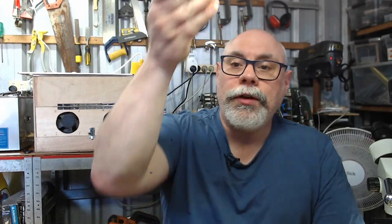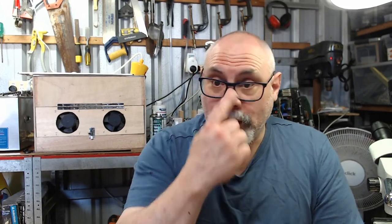So, what are you working on today? We're working on a Macintosh 2. I worked on a Macintosh 2 just recently. A customer dropped in two Macintosh 2s just recently. And they have actually already been recapped by the customer. And at a glance, they actually look like they've been done pretty darn well. So I don't think I'm going to need to recap them, but there is some trace damage.